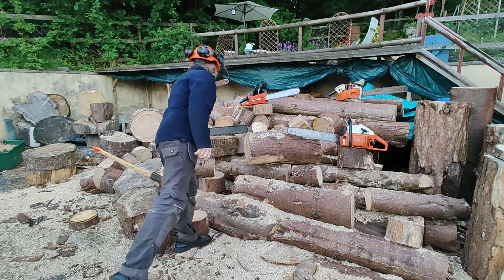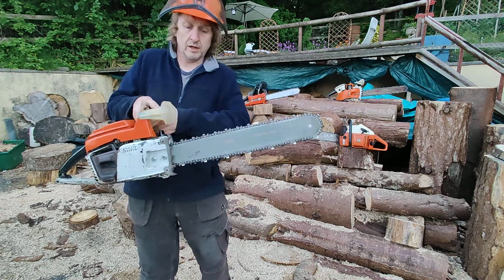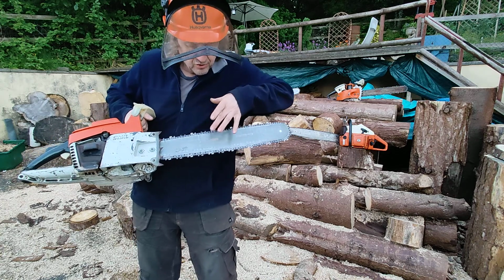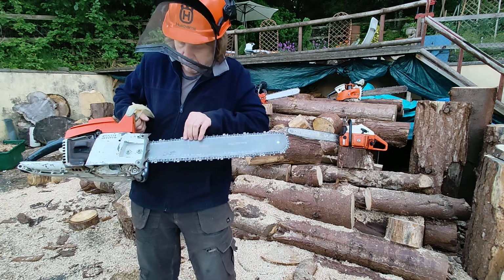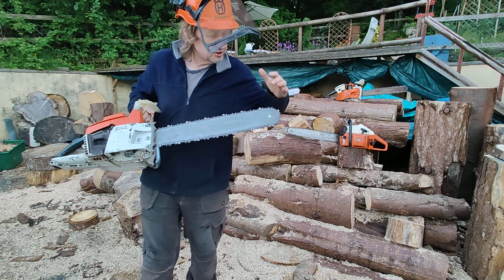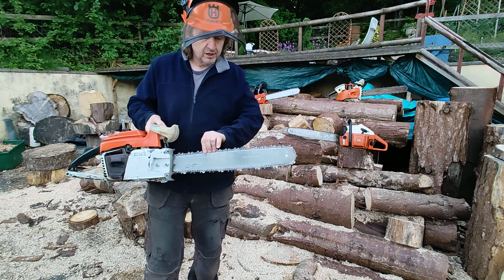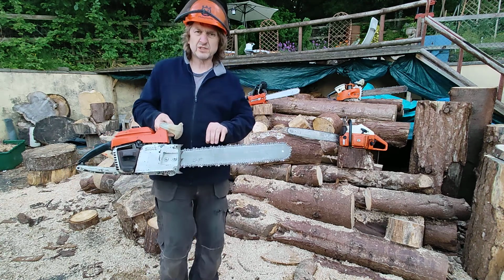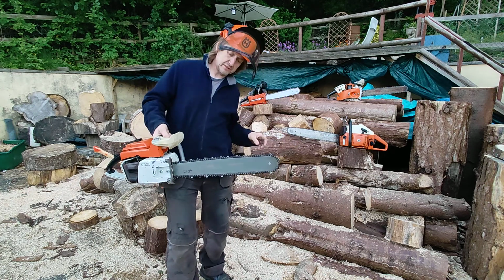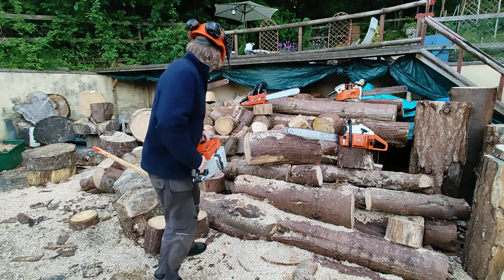This is running the original, this type of aluminium covered coloured Stihl with the original orange Stihl writing on. So that's the original period Stihl bar. Solid nose, so Stellite tip, and running an Oregon Type 75 chain, so 1.6mm gauge, pro chain, semi chisel, and let's see how this girl performs.